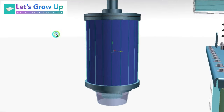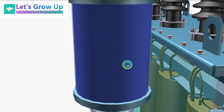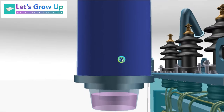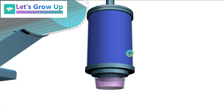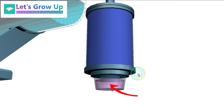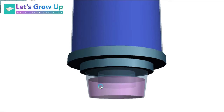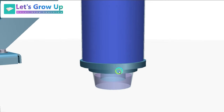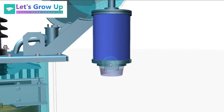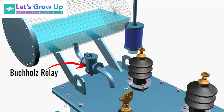That is why silica gel is used inside the breather. When air enters the transformer through the breather, the silica gel absorbs the moisture so that only dry air enters. The breather also has an oil cup fitted to it so that dust particles get settled in the cup. So silica gel is used for moisture and oil is used for dust — both are cleaned by this process and only dry air can enter the transformer.